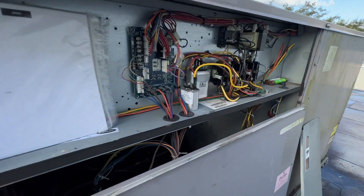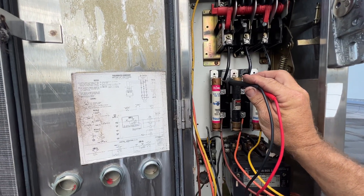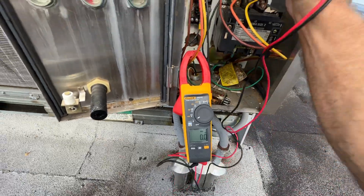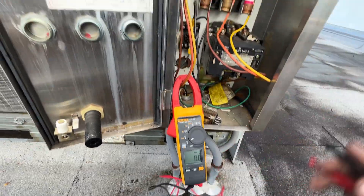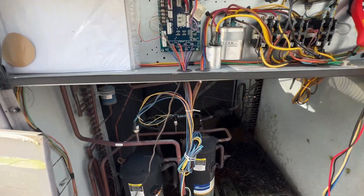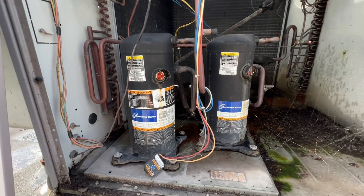That's a typical Carrier — come on, shut off. It's probably timing out. We have lost a phase, and apparently that's got this one blown a fuse. I didn't give up — I just put another fuse in it, process of elimination. Looks like this compressor has already been condemned, and that circuit is flat out of gas. So we might be looking at a new package unit here.